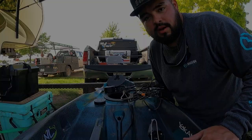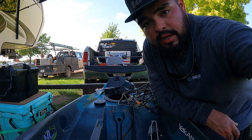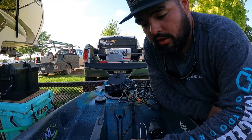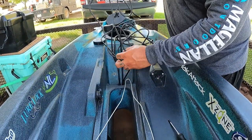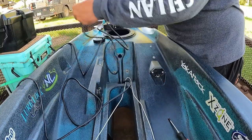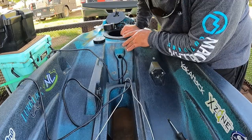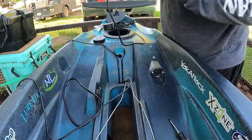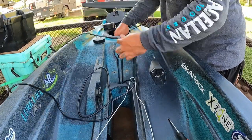Now we've made it back up on top. We're about to get ready to stick the transducer cable back into the hole and start getting that fed through. I like to use a metal hanger — we'll get that all on video. We've got all the wiring — and it comes with a ton of wiring. Whenever I put the transducer cable, I like to take your motor bracket off — to me it makes it so much easier to not have to work around that thing. We're just going to slide all this cable through the hole.